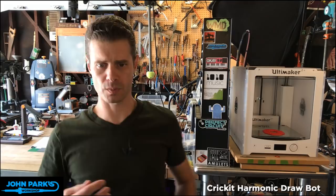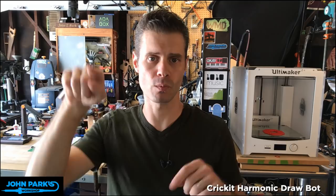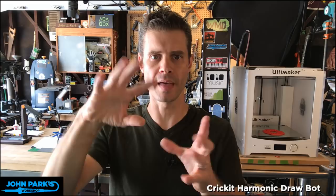There's another type of drawing machine that we're going to look at today that I built, and these come with different names. They are, generally speaking, different classes of harmonograph, and the reason they're called this is they deal with the harmonics of two inputs to the drive, so where the pen point is going, that are either slightly different radiuses or radically different radiuses, or same radius but traveling at slightly different speeds. If you move a pen point with two circles driving them at the exact same time, you'll trace an interesting pattern over and over again, and you'll just have one dark line. As soon as you put one at a slightly different speed, you get a traveling away from the path with every cycle that makes these beautiful shapes.